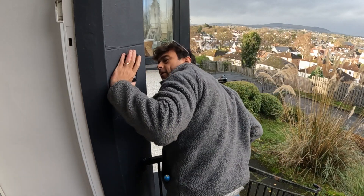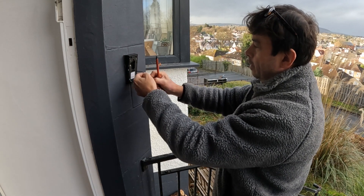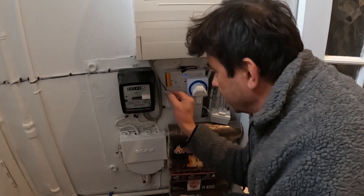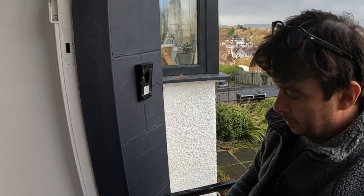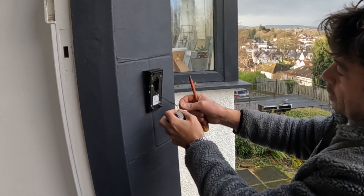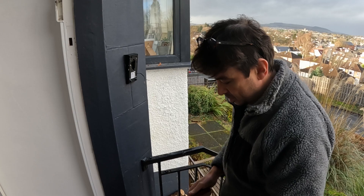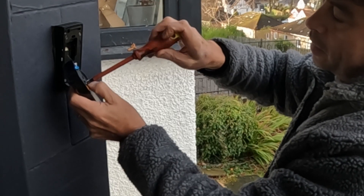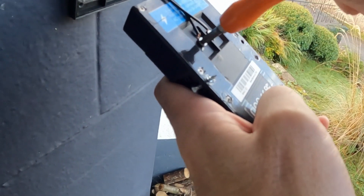I'm going to put the resistor at the plug end - there's not enough space in here and no need to be there, I can just do it at the other end. I'm going to put the one with the dotted line on the right, no particular reason, just so I know. If you put it in the direction you're going to tighten the screw it will twist on better - you're turning to the right so you want the wire on the left so when you turn it it doesn't come away.